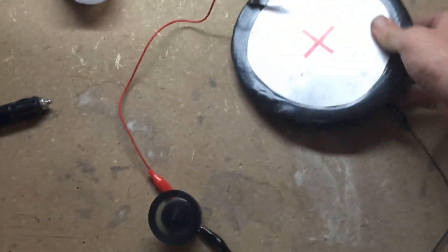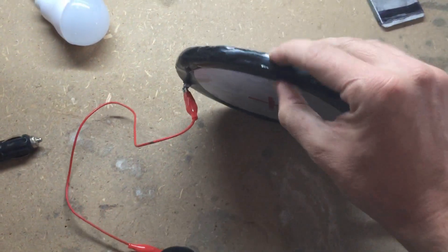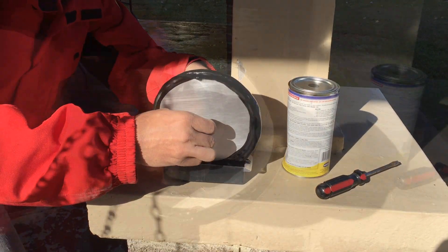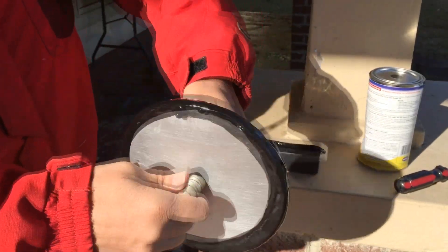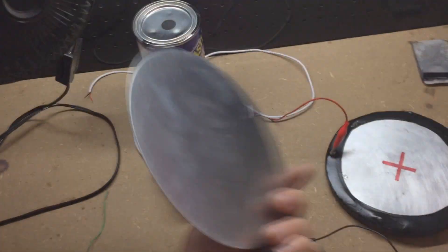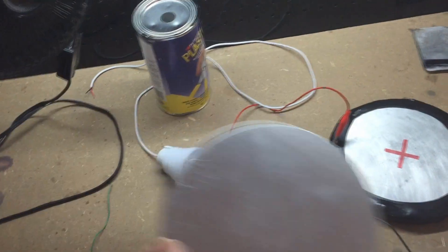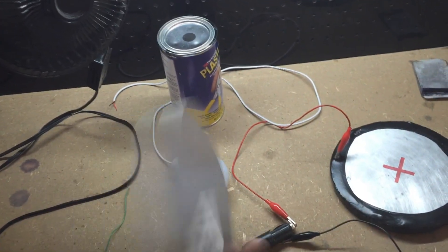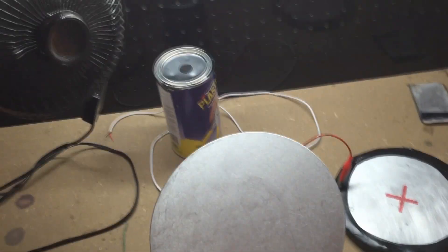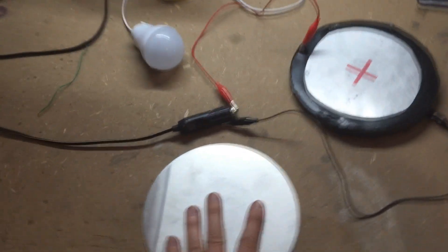The construction of this was pretty simple. You can see the two conductor plates here. I went ahead and got some PlastiDip material and that worked really well — I just sealed it with that. The first one I made I never sealed, and it dried out and quit working as well. This one is completely sealed and I think that's going to make a huge difference in its longevity. At this point I'm linking to Robert Murray Smith's ebook, but as I improve and come up with something easily reproduced and cheap to make, I'll make a step-by-step how-to-build supercapacitor video.